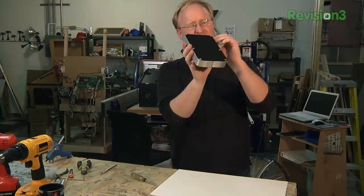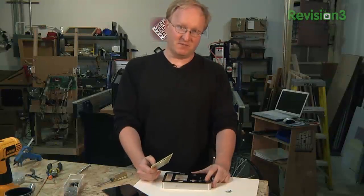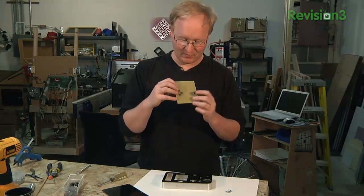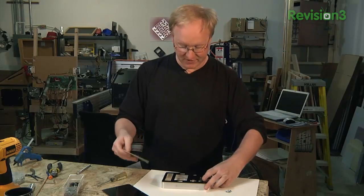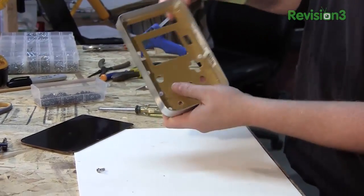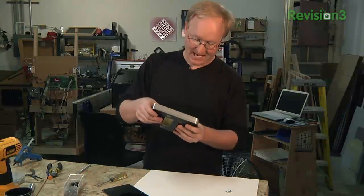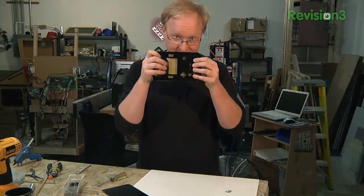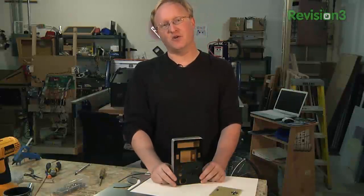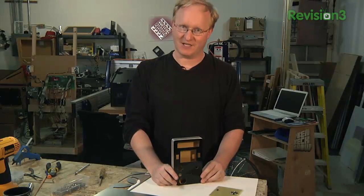It's not super perfect, but it's certainly an enclosure that's in three dimensions with metal sides. Another great way to prototype with these is to use regular perf board with PCB holes drilled in it. You can arrange things like buttons in a pattern, have them line up to your holes, and space them with inner risers that we designed using our paper pattern. When you bolt it together, your switches will be in the proper place for gameplay. So there you have it — I made a case using only my printer and my hands.